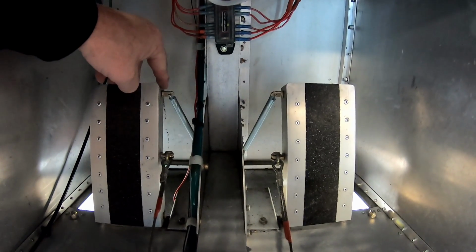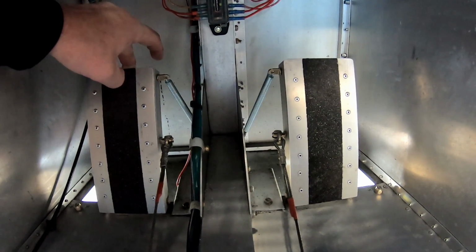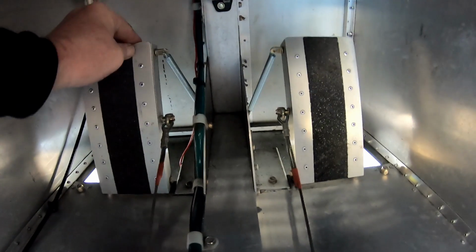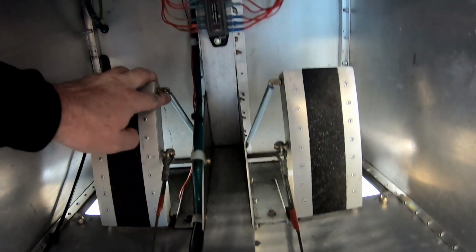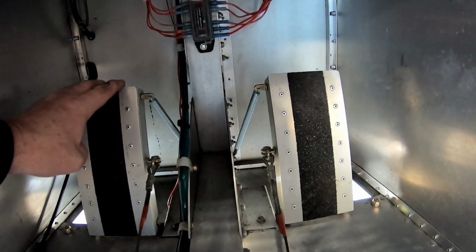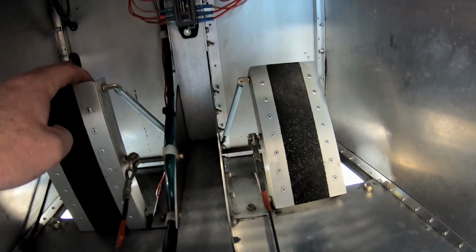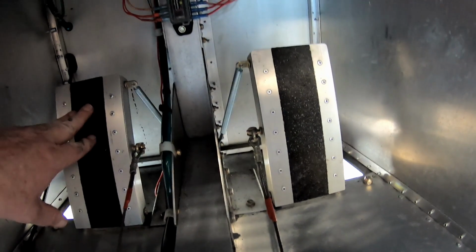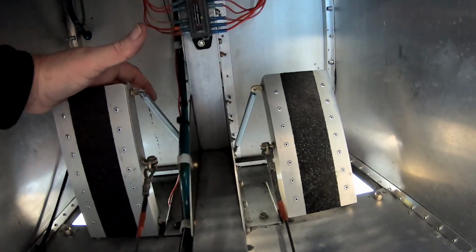So what you see now is an eye bolt, which I replaced the little AN3-4 bolt that was just going through the spring end, and I had a little washer on there. I didn't have them cranked down super tight, but I guess just back and forth over the last year weakened the spring right down here at the bottom, and it just snapped off. So that's why the airplane kept wanting to turn right. Of course, with no spring over here, it caused the pedals to want to do that. And here this whole time I thought it was because of a severe wind.